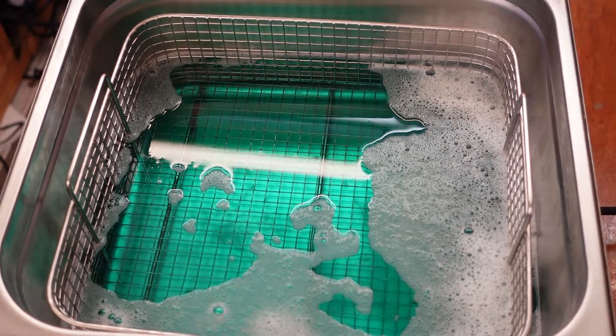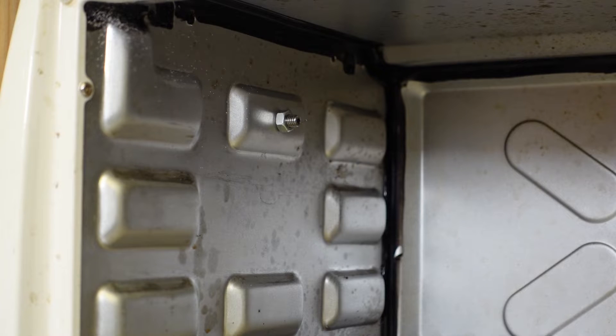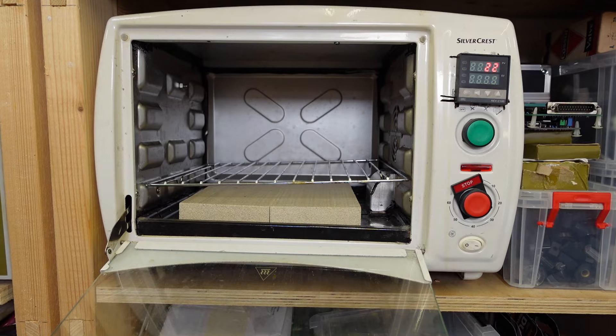For drying the boards when they're done, I've actually modified a cheap little oven. I added a duct to force the air past the element, which I thought might do a better job. It's also got a thermocouple in there for more precise readings and a temperature controller — yes, it is a bit Frankenstein. The fire bricks in the bottom are to stop me putting things on the bottom, because I found that part gets very hot and that's where I've melted things. But I hope that's answered the questions — that's all for me this week, catch you next time.